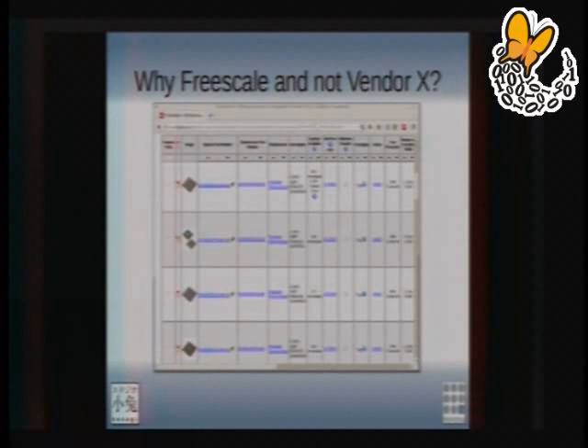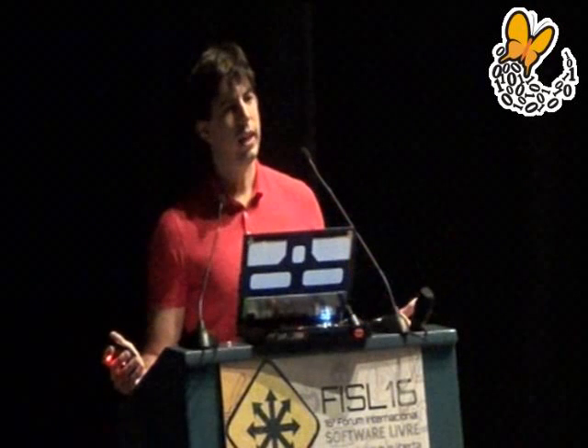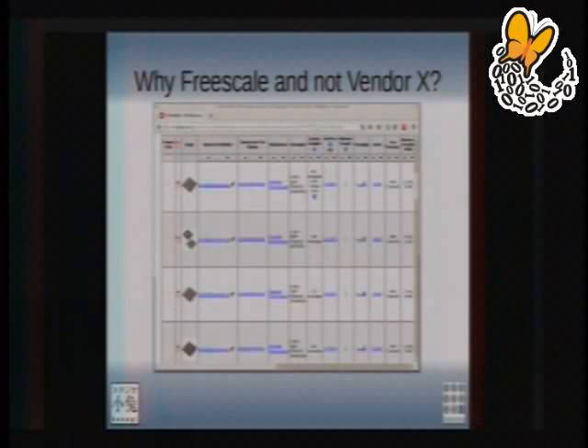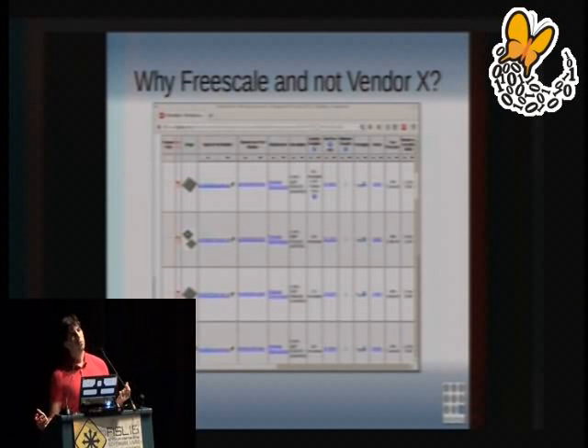Another reason: we didn't want to design in a chip that was unobtainium. A lot of these chips — you can't buy a single Snapdragon or Exynos processor; you have to buy 10,000 or a million. We didn't want to give you the plans and then say you can't actually buy the CPU. With the IMX6, you can go to DigiKey, search for IMX6Q, and get them in quantity one. In quantity one they're more expensive — about $45 — but you can get it. So we're not building something we call 'open' but that you can't actually build.